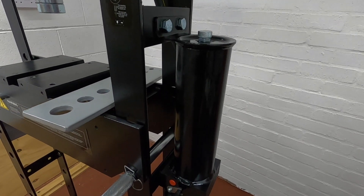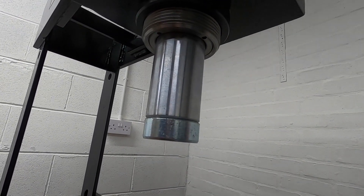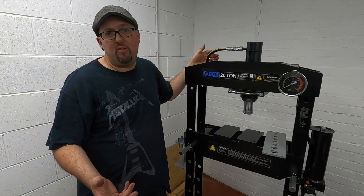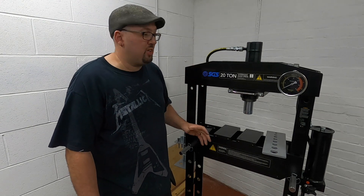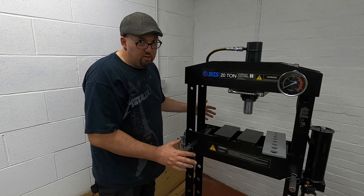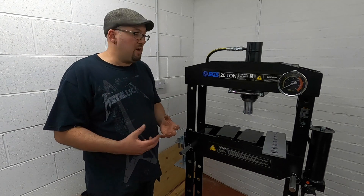The pump itself — as we've already said, it's a 20-ton press. It's got a stroke of 190 millimeters, it's going to work in a range of up to 895 millimeters, and the whole thing weighs 126 kilos, so it's reasonably heavy. The machine itself is fully welded — there's no bolt-together. It comes made. The only thing you have to put on is this little tool tray on the side. That's it. Everything comes as it was, as you saw at the beginning of the video.